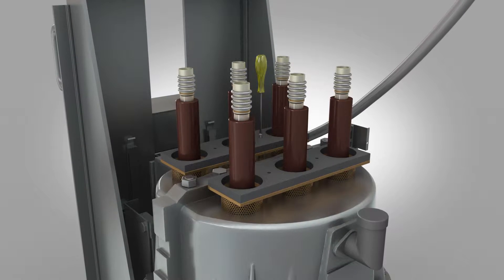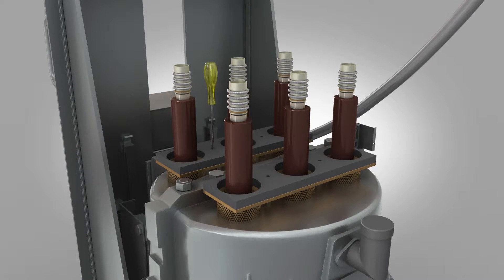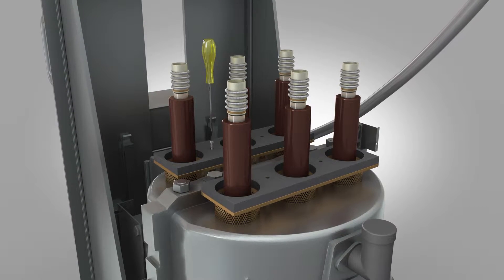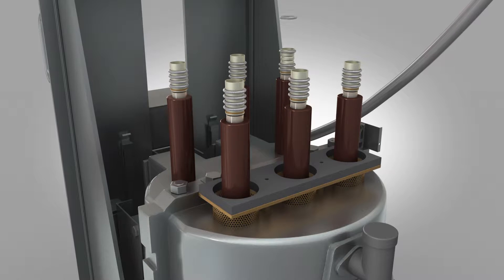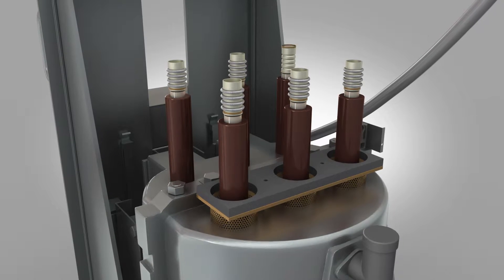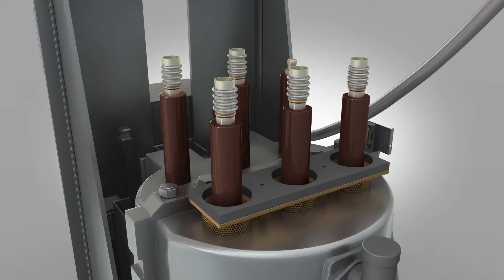Identify the bus side socket fingers. Remove the vermin proofing with a screwdriver. Disassemble the roses, removing the springs first and then the retaining ring at the bottom. The contacts can now be carefully lifted off.